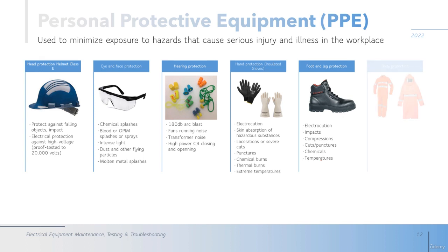The next is body protection. We have two different types. The first is simple clothing with reflective strips — the reflection is important because in the dark, when a light is shone on you, it creates a reflection so you can be seen. The second type is used for protection during high voltage sectioning and when opening connectors in medium voltage; these clothes protect against arc blast because they are made with material that will not burn. The garments protect against arc flash, electrocution, cuts, and heat.